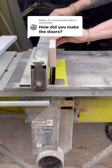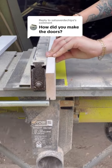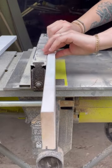You got it. I'm no professional, but this is how I make easy DIY custom cabinet doors. The first thing I do is I get 1x3 finger joint pine, and I run it through my table saw twice like this to create a channel, also known as a dado.